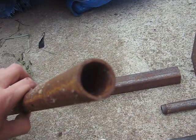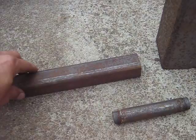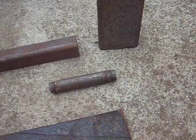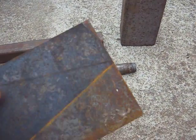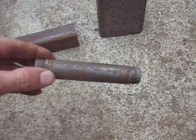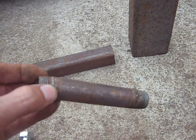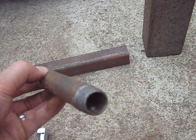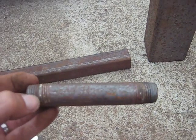1/8-inch wall tubing would also be a possibility, but I go with the square stuff because it's a little easier to work with. For steel plate, I'd recommend 1/4-inch for a motor mount — 3/16ths is an option too. For pipe, this is a 1/2-inch steel pipe. Don't buy galvanized — you don't want to gas yourself out trying to weld it, plus you get a crappy weld. You want to buy black pipe.